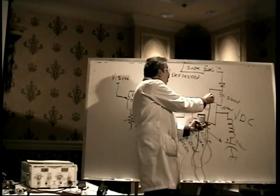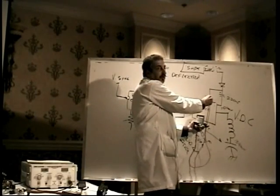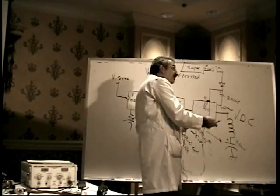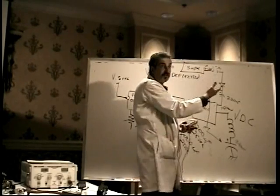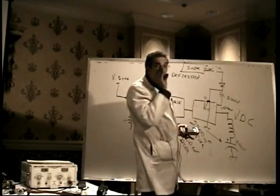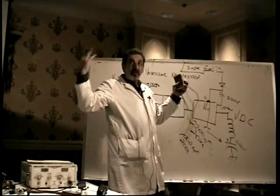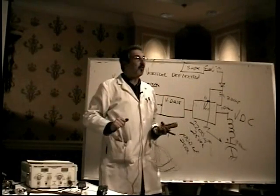By finding very low ohms from the power pin to ground with the power turned off, you've really verified that the chip itself is bad. Then you change the chip at the same time you've changed the resistor. You fire it back up. Ooh, let's remember to change the boost capacitor at the same time. You change all three of those things at once, and then it works.